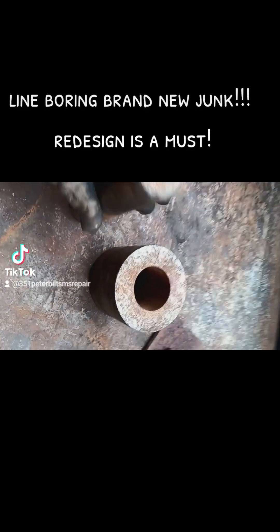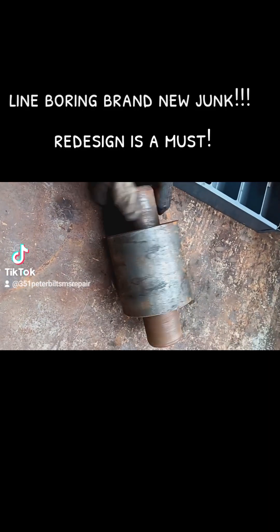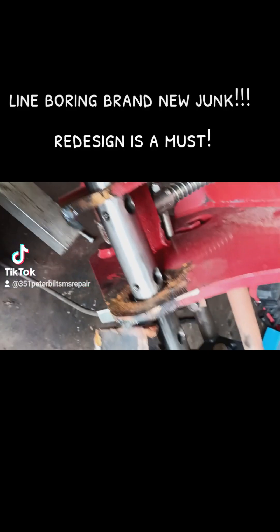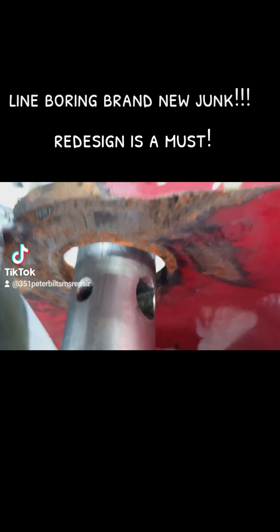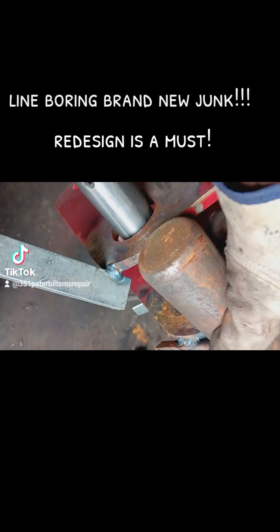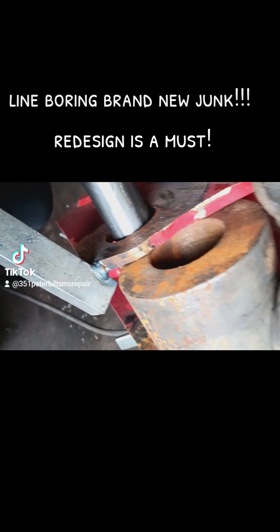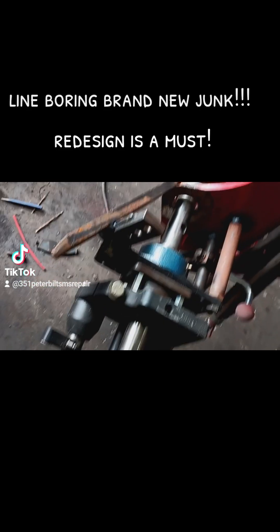Here's our pin. Here's our bushing, which is going to be a boss to hold all this stuff together. We got the boring machine set up. You can see where I had to cut it out right here. So what I'm going to do now is cut it out to where I can fit this pin in that hole right there where the boring bar is — it's going to slide through there. And then this bushing is going to go inside of here for support, keep it from moving. We're all set up and welded in place.